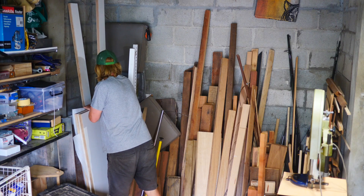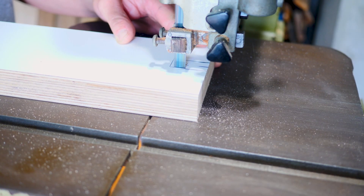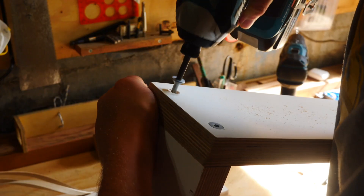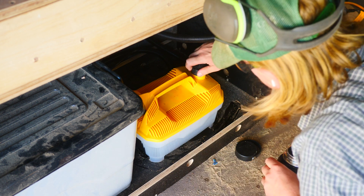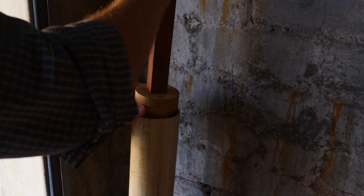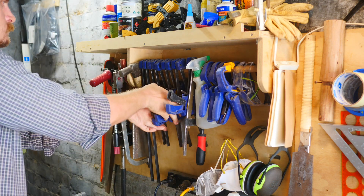I then made a jig using some old offcuts of laminated ply, by cutting two uprights and a notch in each. This way I can position the stem with enough space to bend the strips around and underneath. I guess all there is left to do is fill her up and get steaming. While the steamer gets going, I soaked the strips in water to help them take the bend, and then began setting up some kind of steam bending surgery so I had everything I needed in the few seconds I have while the wood is hot.